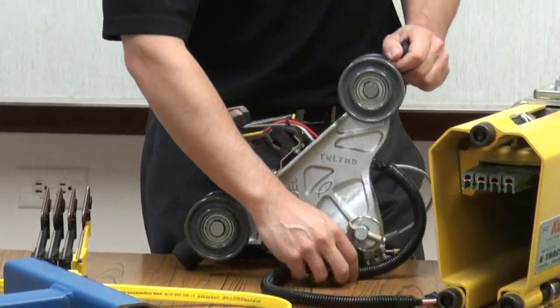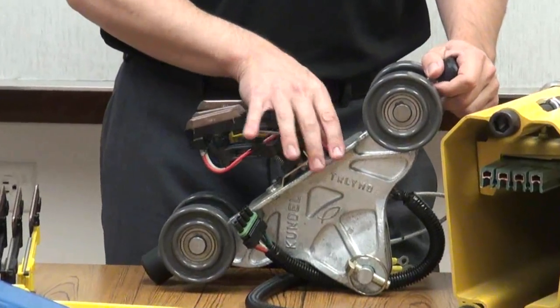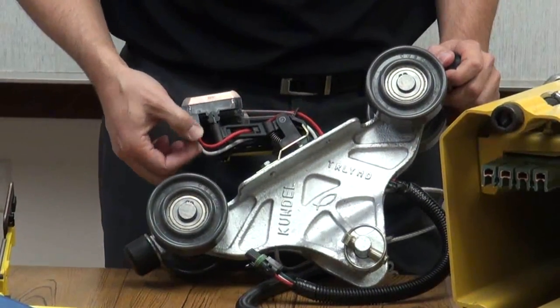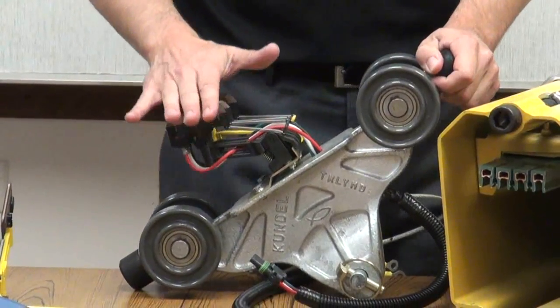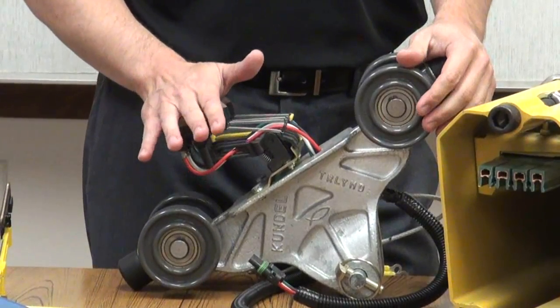There's a harness wire that passes up through the center of this cast steel trolley. The wires come back to the back side, they clip on to this collector shoe, and basically these shoes are spring-loaded so they can slide and travel back and forth and track properly inside this conductor bar track.